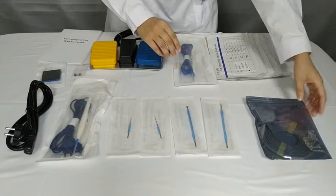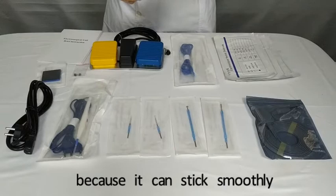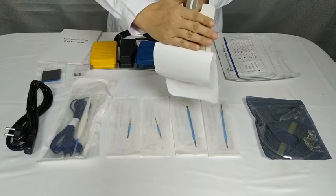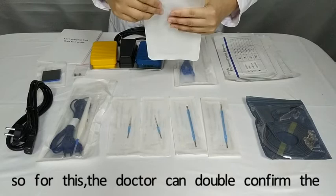Patient plate cable. Five pieces of disposable bipolar patient plate are included. We recommend the disposable one because it can stick smoothly to the body. Our machine also has a detect function — the plate has a double-piece design. If we lose one piece, or if we haven't stuck it on properly, the machine will alarm.